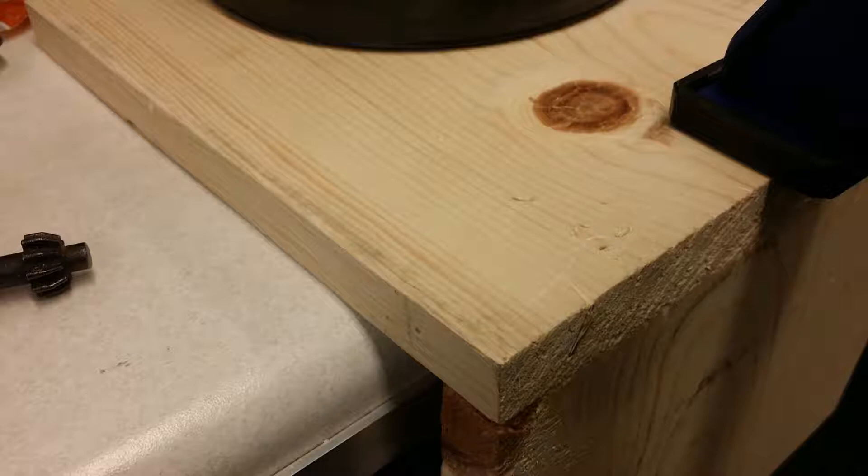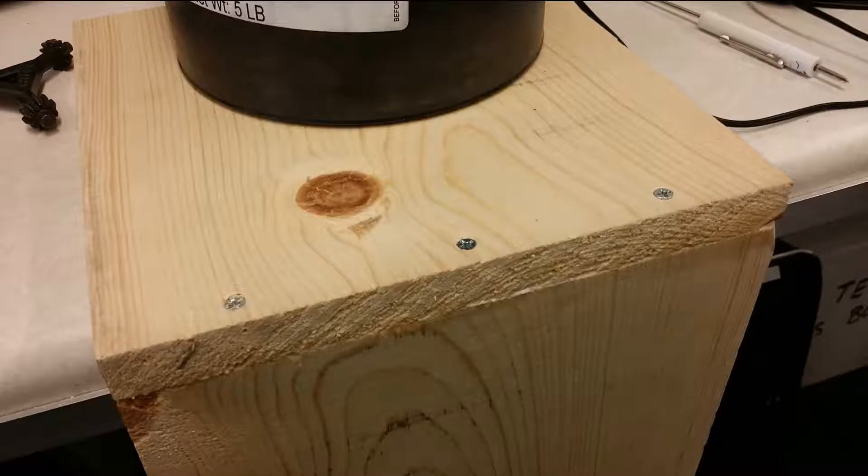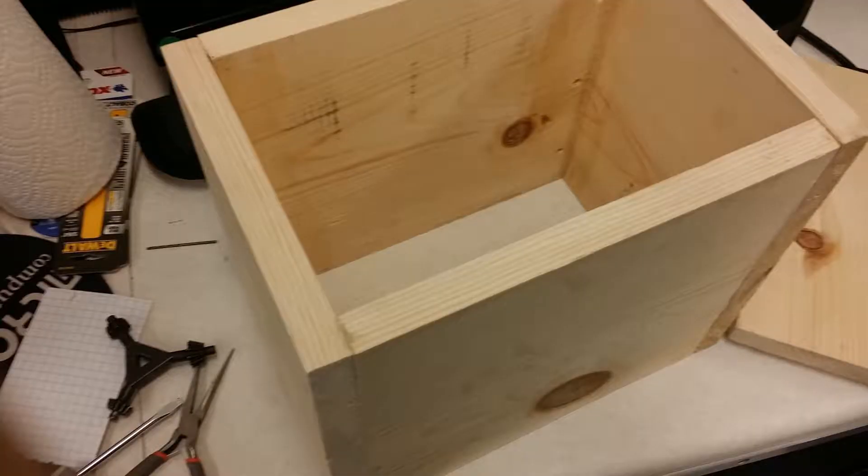I bent the 3x5 card over at about half the width of a board, and it worked very well — when I was drilling the holes it kept feeling like I was drilling them too deep, but every time I measured it was the right spot. I encourage you to make some sort of template and measure where you drill your holes, because you want to go straight down in. I used number six wood screws that were two inches long. I put in about three screws and also glued it with Titebond 3 Ultimate Wood Glue — great glue! Between the gluing and the screwing this is probably a stronger bond than the wood itself. The box feels rock solid, and I ended up with a whole box.